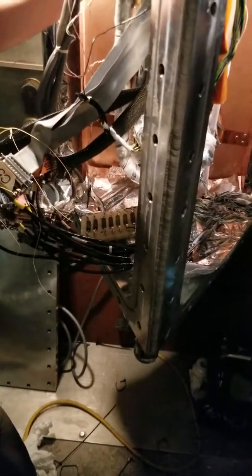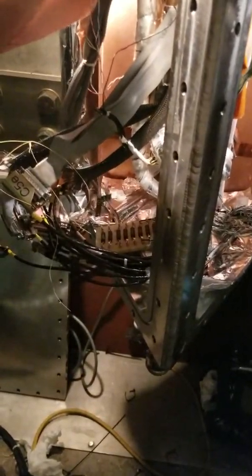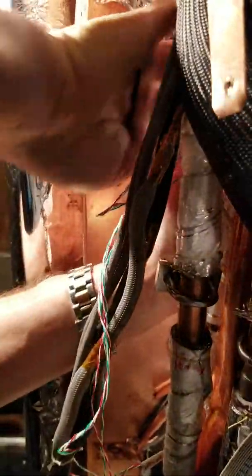These other copper pipes that are wrapped - you wrapped them after they went in, right? Yeah. That looks like it was a pain in the neck to wrap. Of course - each one wrapped individually. I have to cut those three somewhere at a place easy to re-solder. We're just going to put a coupling on. Making this connection was a big deal and it was expensive, so I only did the one that was almost impossible to get to otherwise.